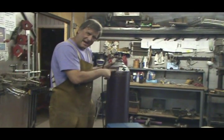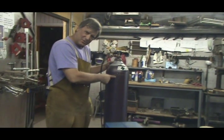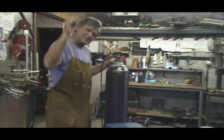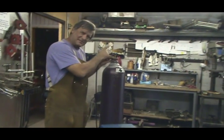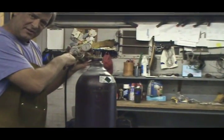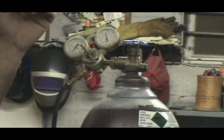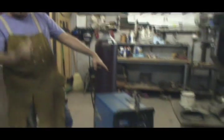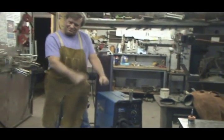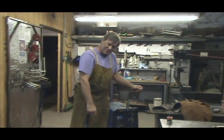There's even a triple gas — it's argon, carbon dioxide, and helium — that works a little better, but the cost is a little more. And then you've got a regulator that shows you the pressure in the bottle and your working pressure for how much gas is actually coming out the end of the nozzle. You need 110. And you're ready to mix parts and weld metal together. Now let's put some leather on and I'll show you what's going on.